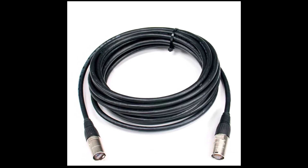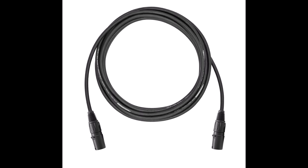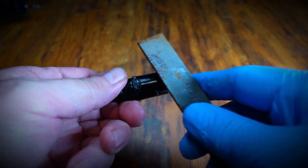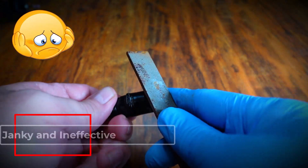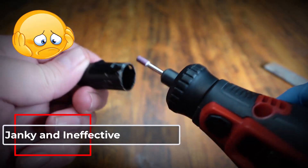If you haven't already purchased your cable, just make sure to get a shielded cable with the silver-colored EtherCon connectors. If you already have a cable with the new black EtherCon connectors, even if you scratch the coating off the inside and outside of the newer ones, the RJ45 still has trouble making contact — so that is not an answer.